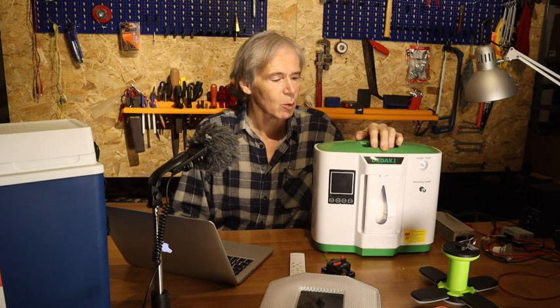A good example of an essential device — also for example in medical centers in developing countries — are devices like the oxygen generator. This one consumes 160 watts. Because it has a kind of compressor, I have to try it on this new inverter to see if it can start, as it will have a higher start-up current. Anyway, it is always good to try an inverter before you buy it on difficult devices like a refrigerator — and maybe this one too.